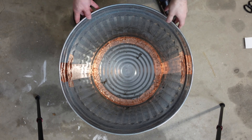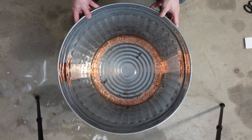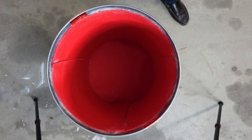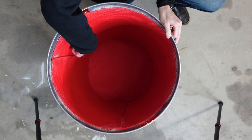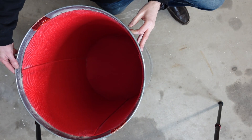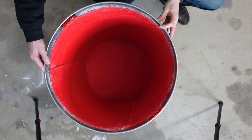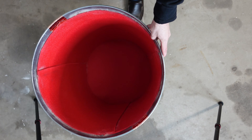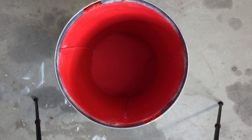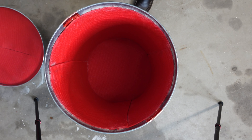When the taping is completed, we are ready to add our non-conductive liner, and we are going to use a yoga mat just like we did with the ammo can. This mat will have to be cut into three separate segments because the trash can has an upward taper to it. The three pieces will be overlapped and glued in place. Just like the ammo can, we are going to put two layers of material in the bottom of the can because of compaction from the weight of our stored electronics.